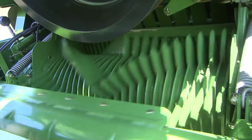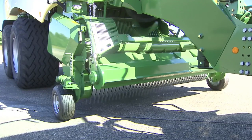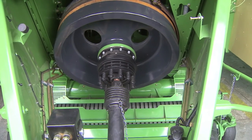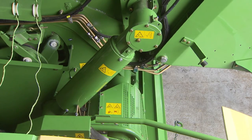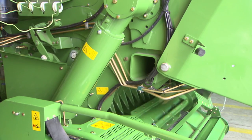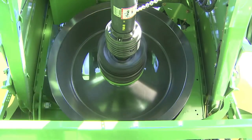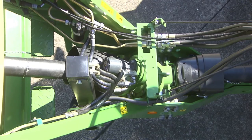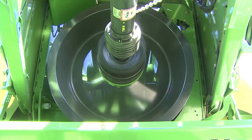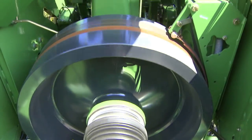It reduces the baler's input requirement substantially, and the current wheel slip and load are displayed to the operator. The shared rotor cutter and pickup driveline is cut when the load is excessive. The pickup on VFS machines is powered directly by the main gearbox and drive shaft, and is protected from overload by an integral cam clutch. The massive, more-than-600-kilogram flywheel makes for quiet machine running. A right-angle gearbox takes care of good driveshaft alignment and increases the speed to 1,180 RPM for more efficient use of the flywheel's inertia and very smooth operation.